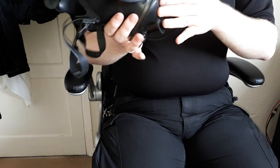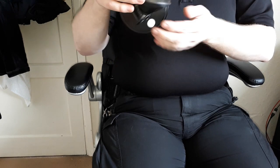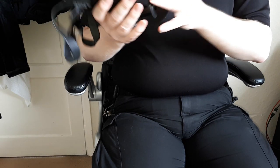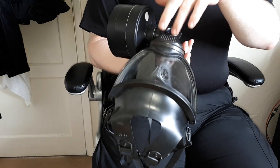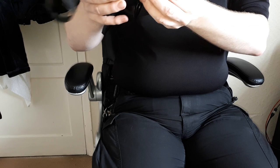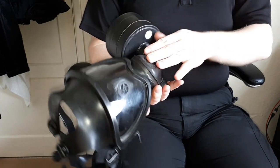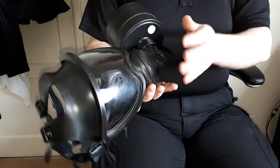But once I cleaned it, it got rid of whatever gunk was in there. So just make sure the water drips through so you can see it coming out, and also pour water onto the valve from the outside to get it to both open and fully close.